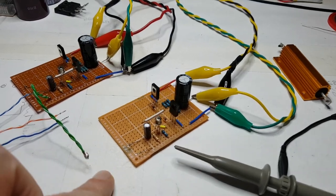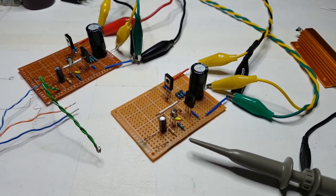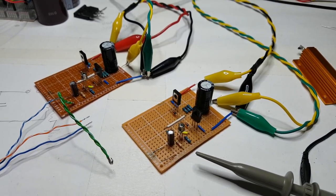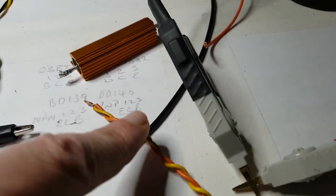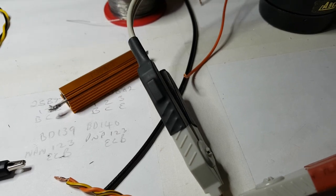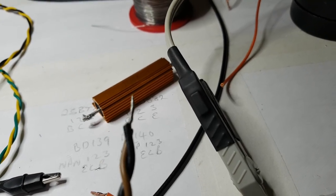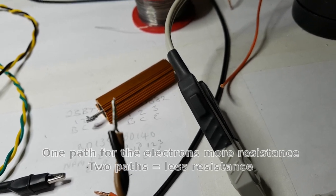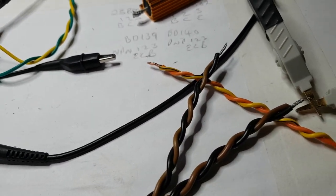I'm going to do the power test for these little amps, one on each. Not that I think there should be really any difference, but it would just be interesting to see. There is a little bit of a difference between the betas on these transistors. There was more resistance in this one than here, and more resistance in one piece of wire than the two pieces - with one piece there's only one channel, with two pieces there's two channels in parallel.